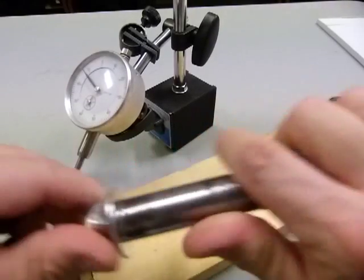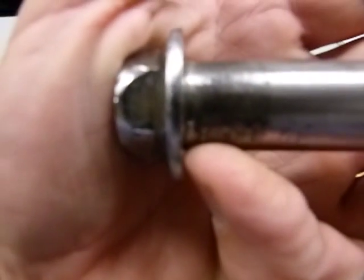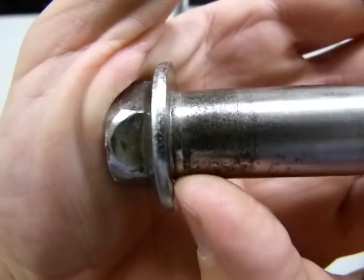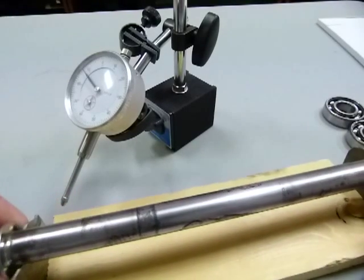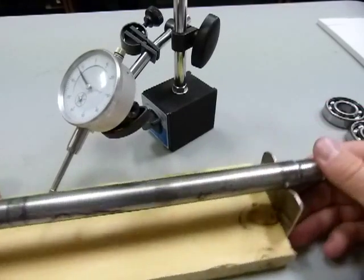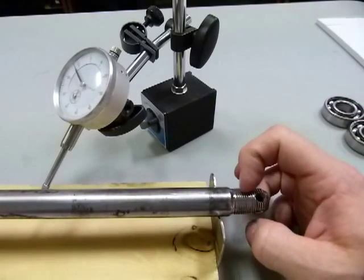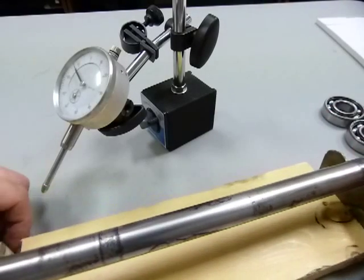At the end of the axle here there's a slight notch — I don't want that slight notch to be in the V gap. I want it positioned just like so. I don't want it to fall into that little gap, and I don't want to be running on the thread either, because that will throw off my measurements as well.